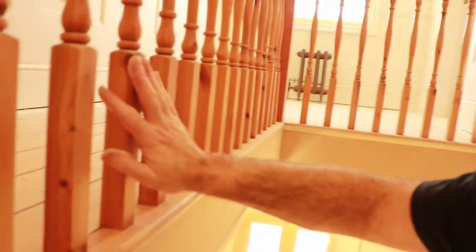But again, just be careful, control your fan pattern, control your paint. I'm just going to show you up here, look. I've got no walls that are finished at the moment, there's only ceilings. So anything that's a ceiling, like this bottom edge there, I'm just going to put a piece of card just to protect it. If there is a bit of overspray, I can just touch it up because you won't see it, but I'm not expecting to see much overspray on there.